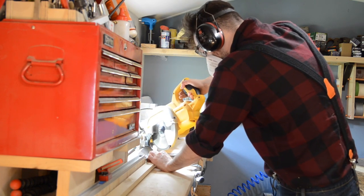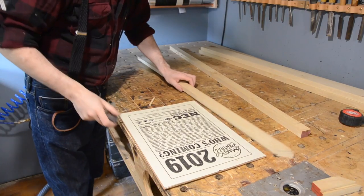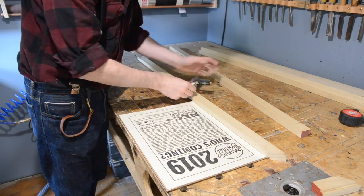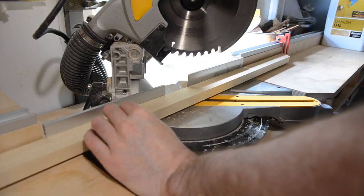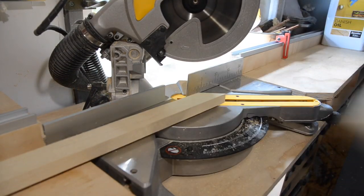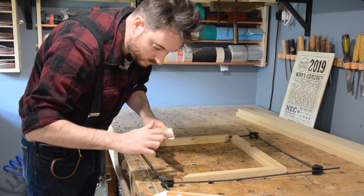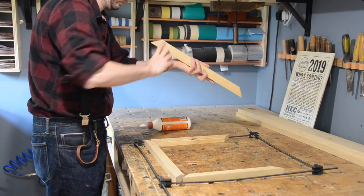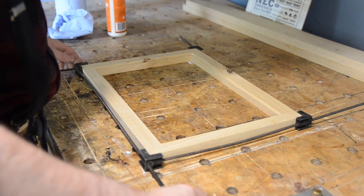With the rebate cut, I can start cutting the miters for the frame. With the first one done, I get it put over the poster and I can mark out where the second one needs to be made. With that mark done, I can then set up a stop block so I can get both pieces cut to the same length, and I do this process for the long and the short sides. Then I can get it all glued together. Here I'm using my Veritas clamp to pull everything together - you just screw these nuts up and it really helps pull everything square.